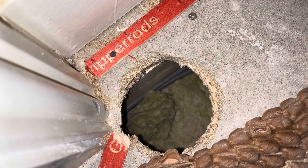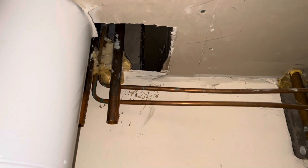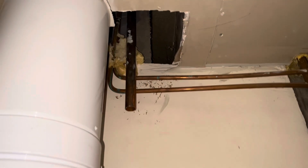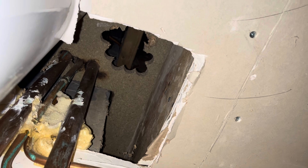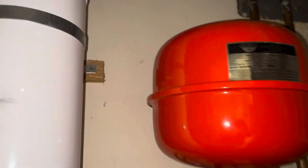There's some insulation in there — I'll pull that out and then I just need to decide where to make the hole in the plasterboard underneath. Back in the boiler room, I've made a bigger hole in the plasterboard up there with a screwdriver. I've got the borer on the drill and I'm about to make the first hole in the chipboard. That first hole has gone through nicely with nothing in the way. I've now made lots more holes, enough to get my hand through, and the next thing is to feed the pipe in and make the hole exactly the right size. We've got all the holes through the chipboard — I need to make a couple more holes in the plasterboard to get the pipes through and make those chipboard holes exactly the right size. I've ordered the pipe and in a few days it should arrive and I'll make some videos about actually fitting it.